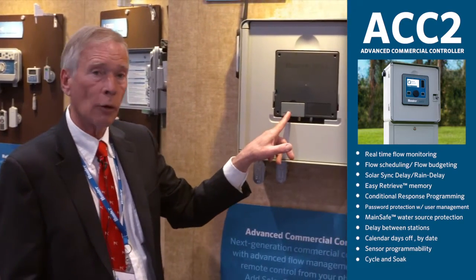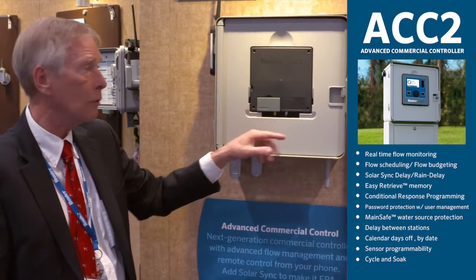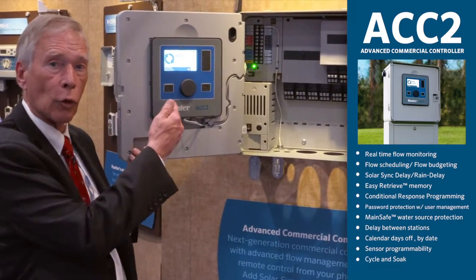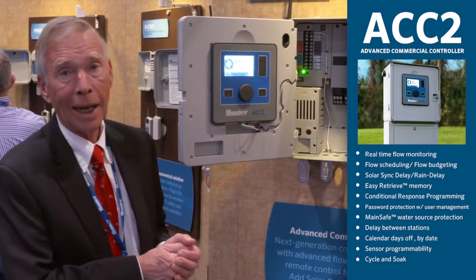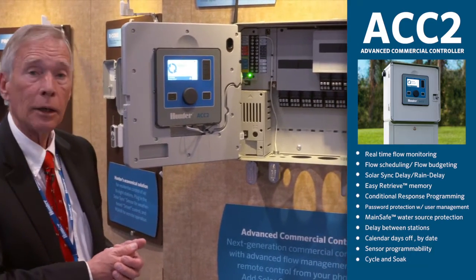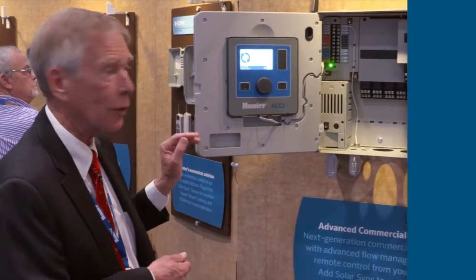I can leave the controller like this and it is fully capable of automatic irrigation. Note the optional Wi-Fi module — it plugs into the face pack, hosts its own web page, and is set up for a direct connect from a mobile device to allow you to use it as a remote control. You can enter names, view your flow sensors — all six of them — and it is also set up for future connection to central control with its own router chip.